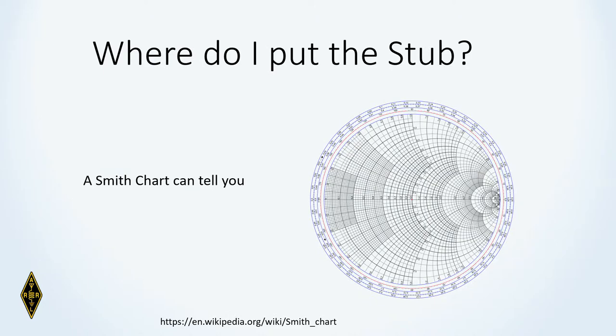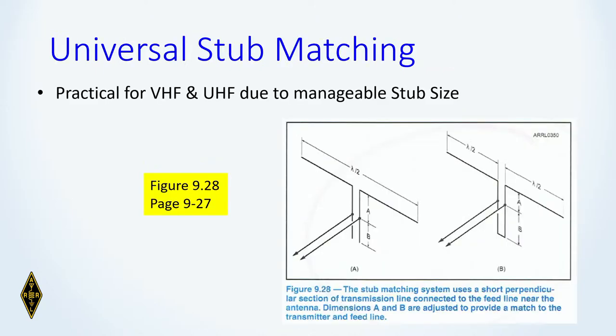And we're going to talk a lot more about Smith charts here in just a little bit. They talk about also in the book something called universal stub matching. And this, if you're out in the field and you've got a match to a VHF or UHF antenna, and you see that there's a bunch of reflected power coming back, but you have no idea what the feed point impedance of that antenna is, what you can do is just hook up a random length of feed line